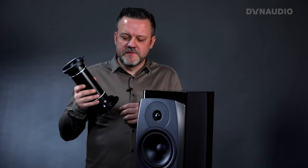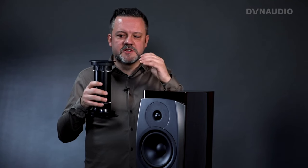So why would you use a larger port? With a smaller port, the air velocity increases when you're playing the same frequency, and at a certain velocity you start to get port noise — you can hear the air going back and forth inside the port. By making the port larger, you don't need as much velocity to move the same amount of air back and forth, so you can play louder without any noise from the port. It's always an advantage to have a large port.